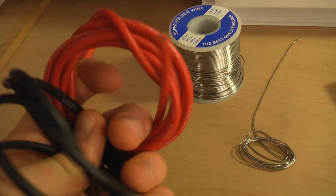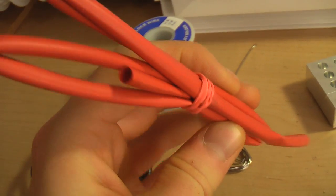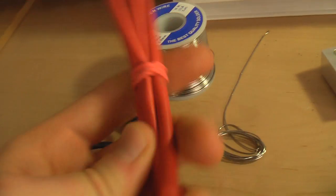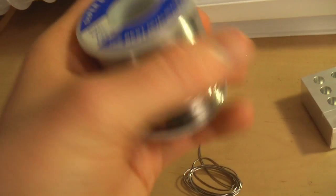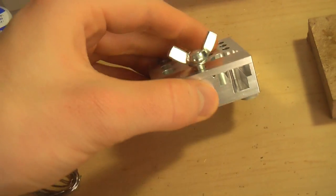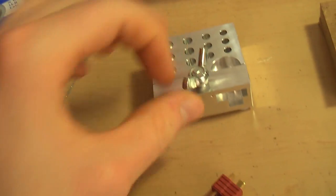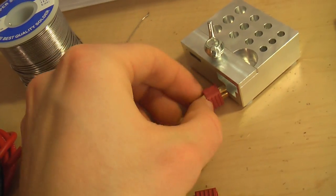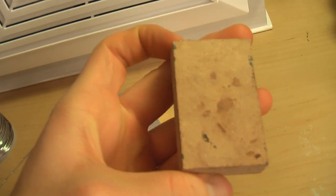What you're going to need is just the basic stuff: the connector, some wire — this is just some 12 gauge silicone wire from Hobby King — some heat shrink tubing, like four, five, or even six millimeter tubing should work fine. It all depends on the type of wire you're using. I think this is five or six millimeter tubing but can't be sure. Some 60-40 rosin core solder — this is great stuff.